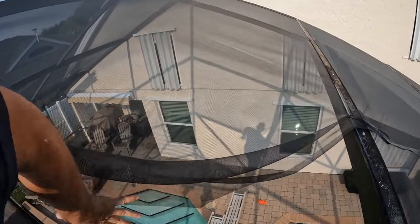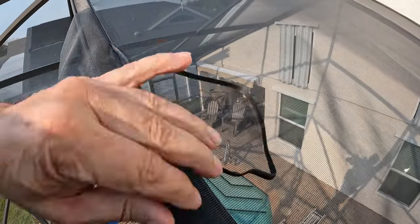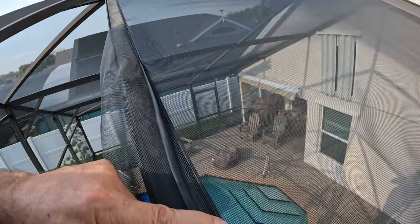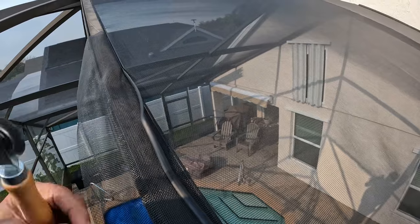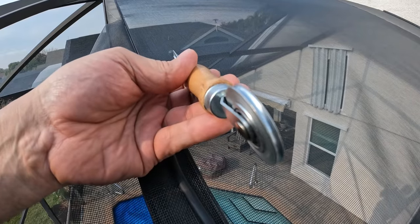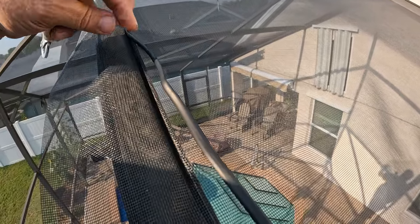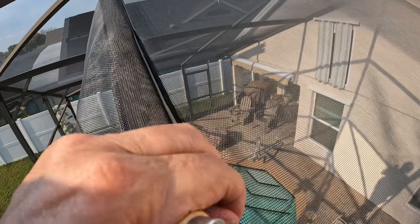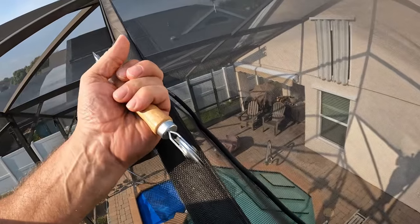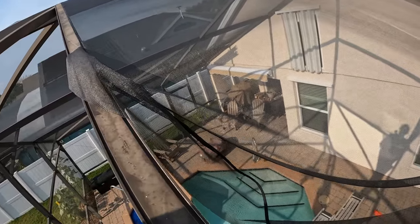I'm at my corner, so I'm going to pull this tight. You can use clips if you want, or with experience you can pull it tight by hand. That's the roller system I use — a double end and a single end. I pull them tight, put a groove right in there. You pull tight and stretch the rubber just a little bit, then use the concave part of the roller to roll it right in, tighten it with the thin narrow part, and just keep proceeding, keeping it tight all the way through.